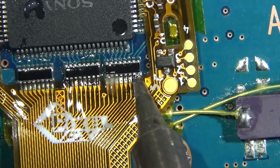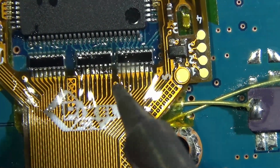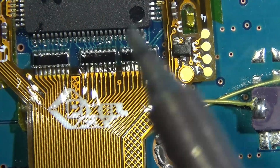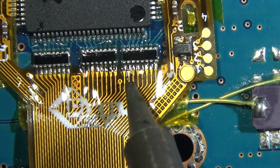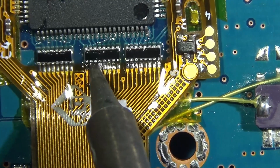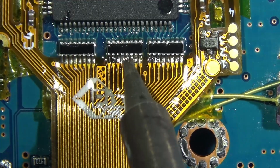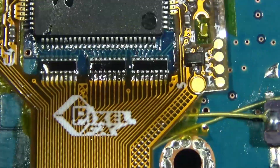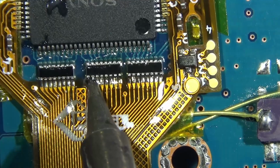We're just kind of transferring solder over, and you'll notice when you drag, it will kind of drag out the nice joints you get with those teeth. We see quite a bit of teeth. We don't want that. We don't want to see them teeth. We want nice meaty joints. These are double-sided, so you know it could be connected totally solid on the bottom, but we want to visually see that it's looking real nice.